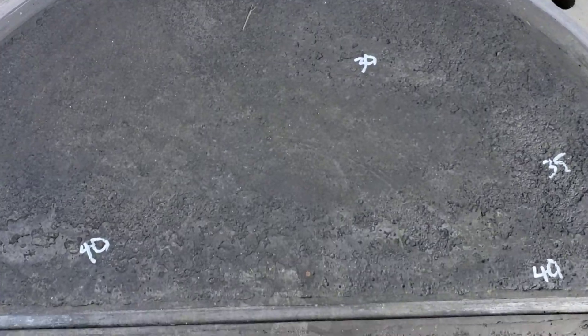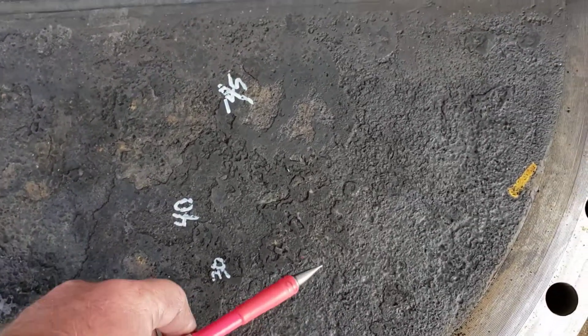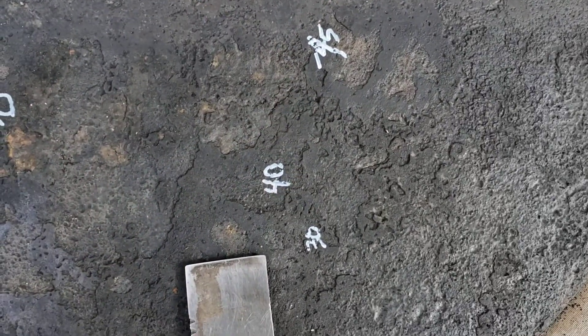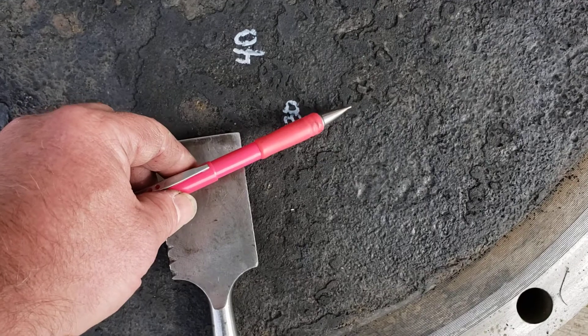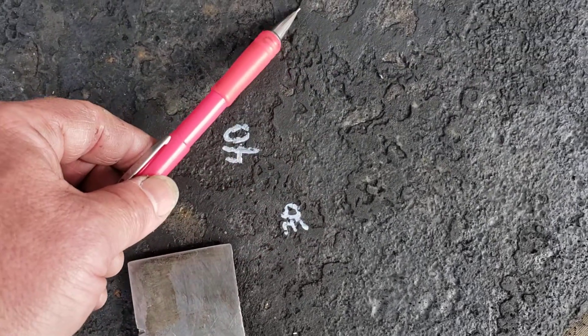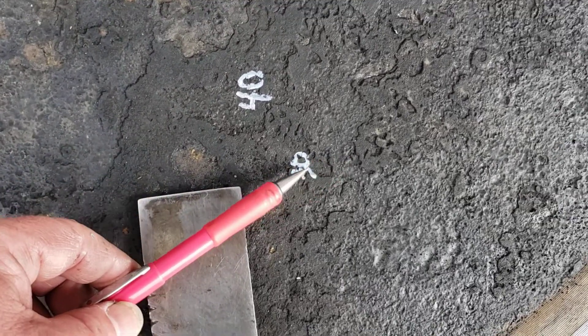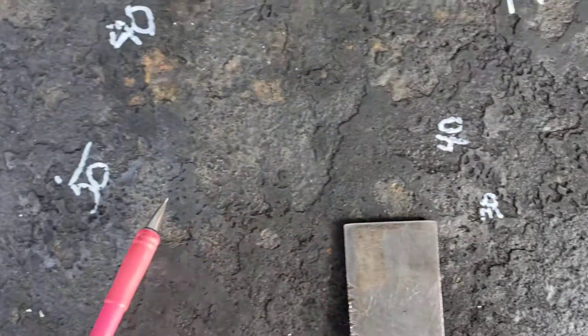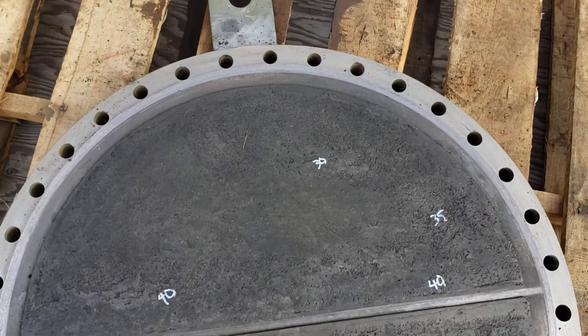As you can see, I've done some pit gauge measurements with my Thorpe gauge, and really, although it's nearly the entire surface uniformly corroded — bridging from the original machined surfaces, which you can still see in most places, down to the corrosion — it's actually going between 30 and 50 mils deep.